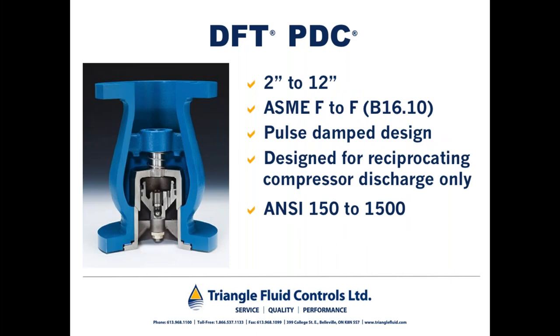That brings us to the model PDC. Folks, this is a valve that's designed specifically for reciprocating compressors. So you would never ever consider the use of this valve on a liquid application. PDC stands for pulse dampened chamber.